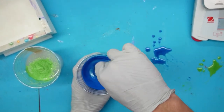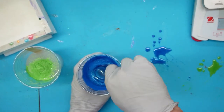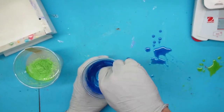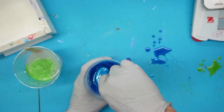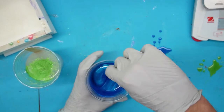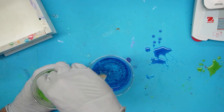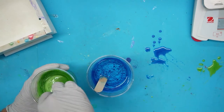This stuff's actually thinning out a little bit, feels like, which will happen a lot of times. It's funny because at room temperature, liquids generally get thinner in viscosity the warmer they are. But in the case of Alumilite Clear Slow, it starts warming up and then it actually gets thicker. So this is kind of an opposite effect here. Tells me that I think we're on the right track. Do you think we need to wait a little bit longer?